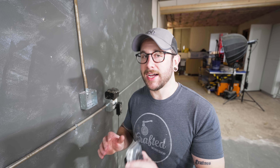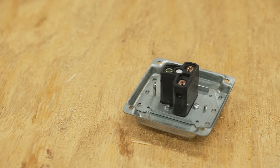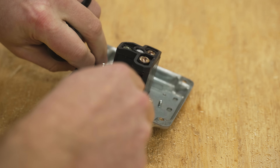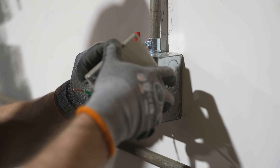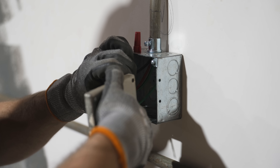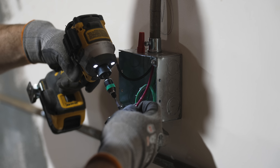Once everything was landed back at the panel, I could go ahead and make up all of the outlet boxes. I personally was very intimidated by 240 volt circuits, thinking it must be twice as difficult, but in the case of all of these power tools it's actually even easier. I have two hots and one ground — there's no neutral — and it doesn't matter which side of the outlet you put the hot on. I like to use the style of outlets where you can just put the wire straight in.